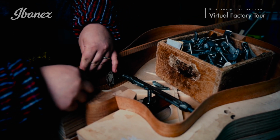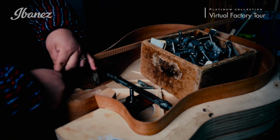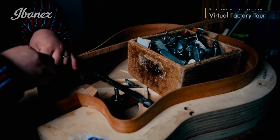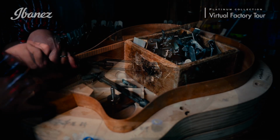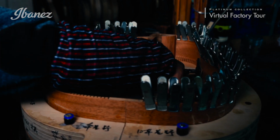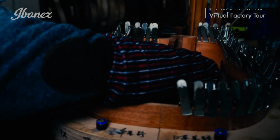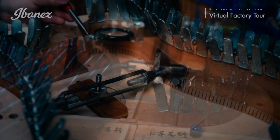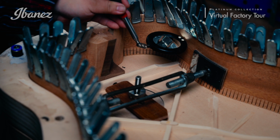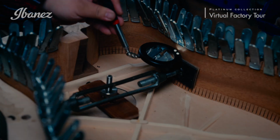The next step is final assembly of the body. This begins with the installation of the interior lining. Deep cuts are carved into this lining to allow for full and rich vibration of the wood, which helps to maximize the tone and timbre of the instrument. Absolutely no effort is spared during the process, in order to ensure this lining is affixed fully and evenly. The interior construction is critical to the tone, volume, and sustain of the guitar, so careful handwork is required through these steps.